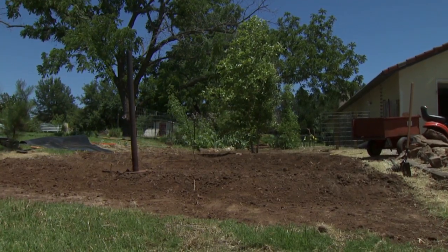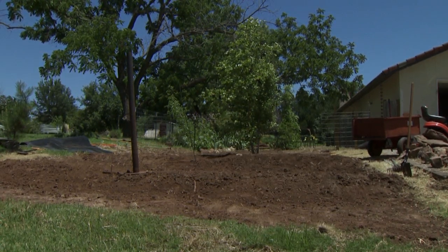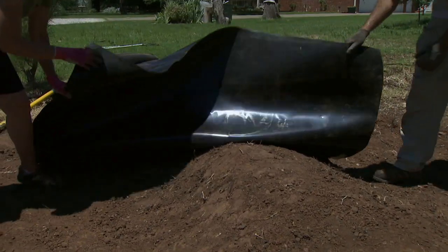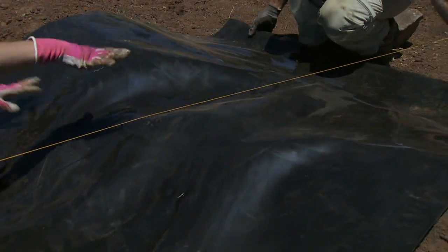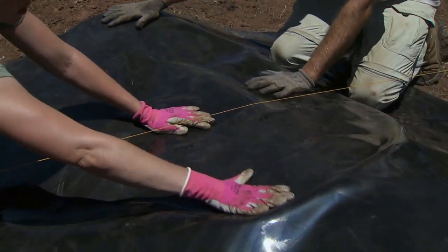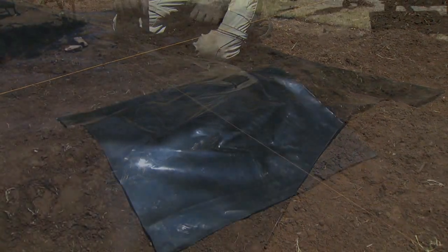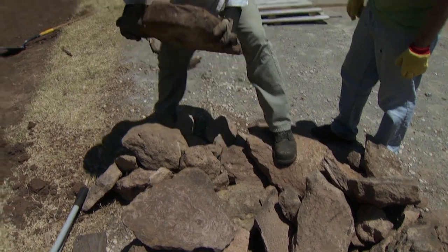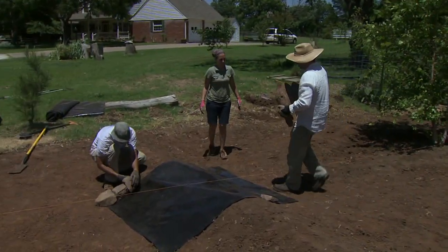The overflow is lower than the upper edge of our pool, so we won't have any water backing up into the landscape. To hold the soil back, we're going to put in a liner — we can use any kind of erosion control fabric or plastic liner — to keep water from moving the soil out. The liner needs to go up on the sides of the berms on both sides, completely covering the whole channel structure to prevent erosion of the outlet. Then we'll cover it with stone to hold it in place in a decorative manner.